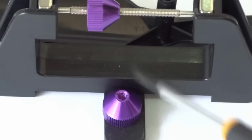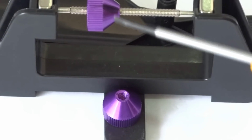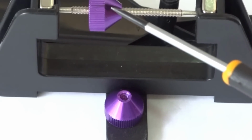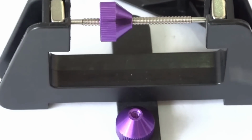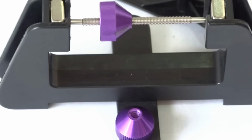And one thing, even if you had another model and you wanted to balance the shafts, I'd suggest that first of all you balance the actual cones, because they're out of balance themselves. You can probably see I've got a black mark on the cone just there, and if I just turn the shaft a little, you can see it turning now and it's come back there, so I'll just use my finger and touch it a slight bit. As you can see, it's heavy on the bottom there, so that's something you might want to look at. And there's the other spare cone there, and that one does the same thing. So the cones are out of balance to start with.